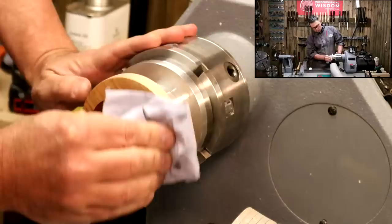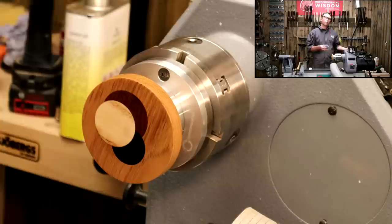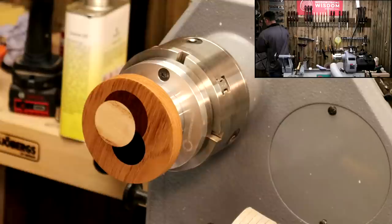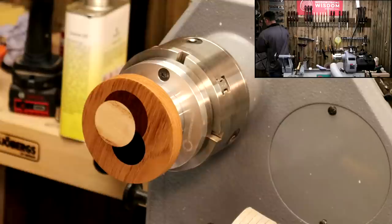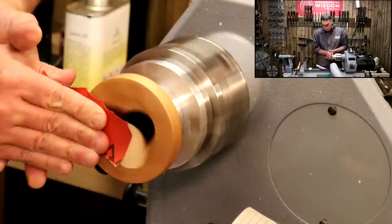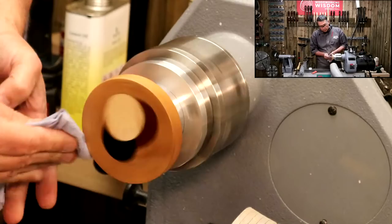I'm using a lemon oil here because my finishing oil has just run out. Lemon oil is a citrus oil — one of the natural oils. What a lemon oil won't contain over a finishing oil is a dryer, so you're going to have to wait a little bit longer for it to dry. Use the old technique of sanding the oil in: go with 600 or 800 grit abrasive, lathe speed right down to really slow, sand it in, create some friction, and burnish the slurry that builds up between the dust and the oil. This will give you a lovely silky finish. Apply the oil three or four times and you get a really nice finish — that's true of all the oils.